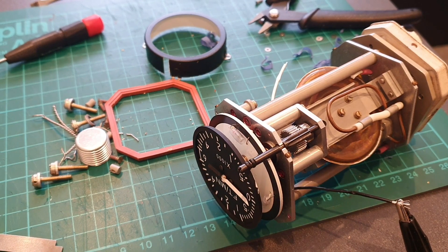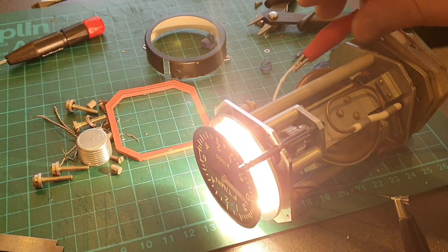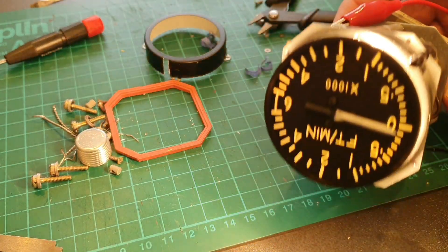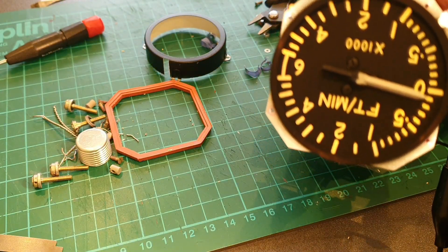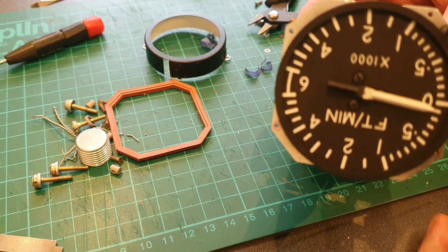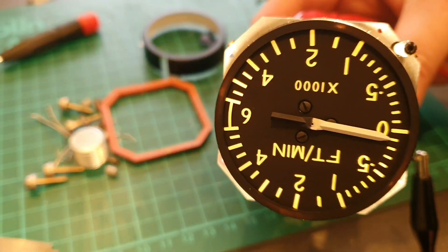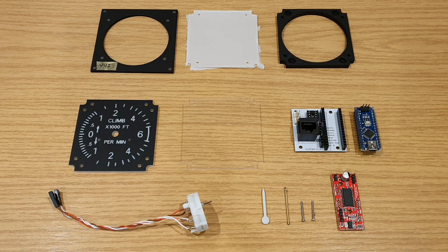Getting the backlighting to the right colour would be a lot of work. It becomes quite clear that the VVI is a very straightforward gauge to make, literally consisting of just one X27 stepper simply behind a piece of acrylic. Although I've used real aircraft parts in the simpit elsewhere — such as a landing gear from a Tornado and toggle switches from a Tornado for the armament panel — for the VVI I've decided to just build it fresh from my own parts.